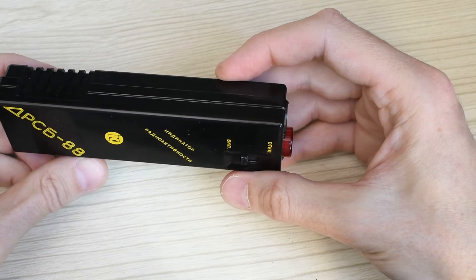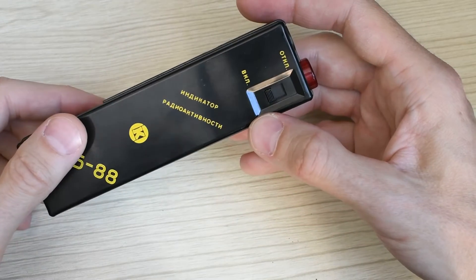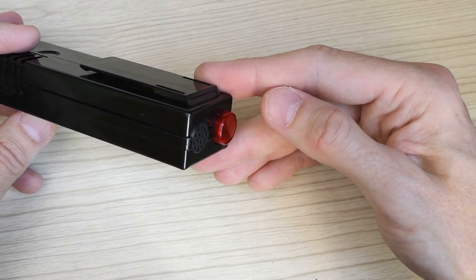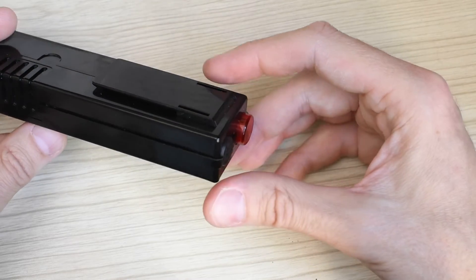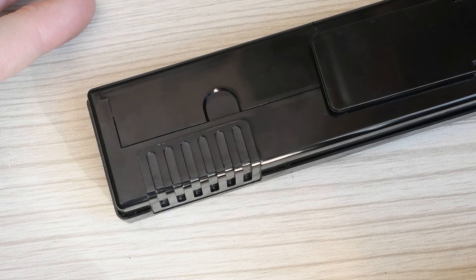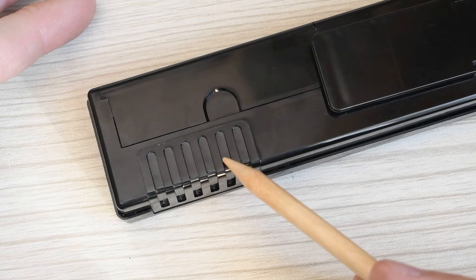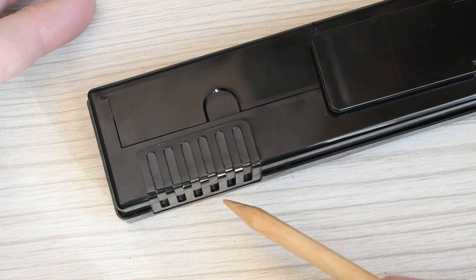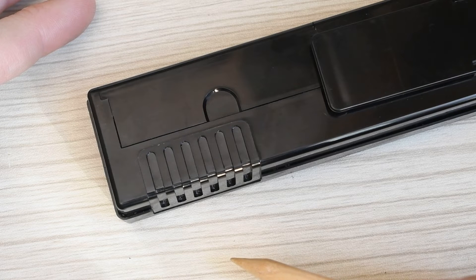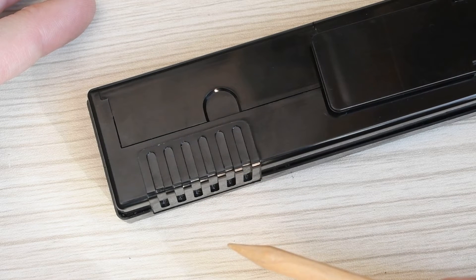The clicks are fairly quiet, but at least they won't be irritating. The light flashes are also proper — lamp-type — since not an LED but a normal gas-discharge thyratron is used. If you look closely at the device body, you can see recessed ribs — that is the location of the SBM-21 counter. The walls of the body are thinner there to allow beta particles to pass through.